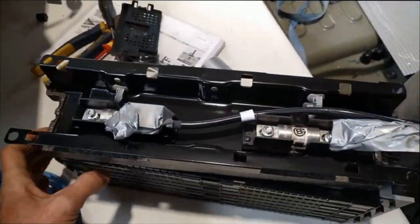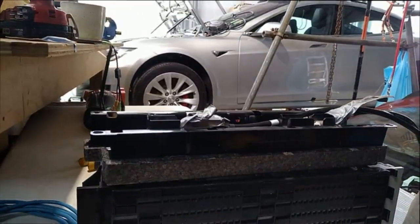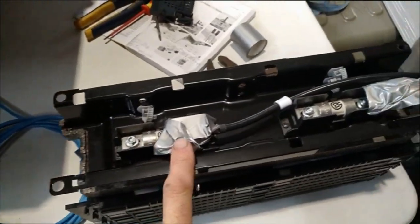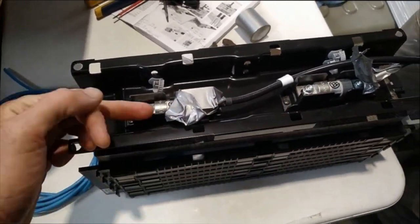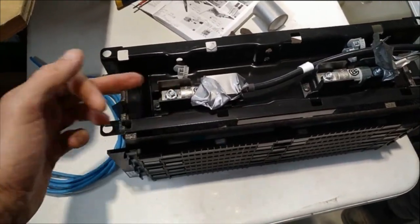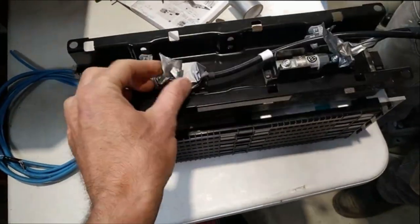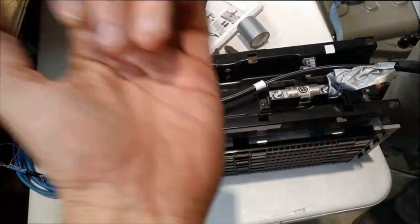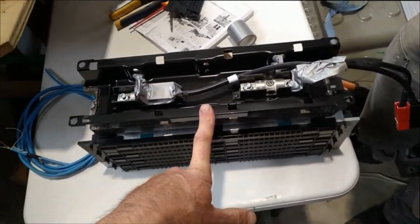The power from the battery comes up and out through a couple of fuses. This sits on top of everything. This unprofessional insulation is mine, because I was horrified when I saw inside. You've got the negative from the battery here and the main positive here, then fuses — and it just sits there with no insulation. It had zero, nothing on top of these when I received it. So you could be in here, drop your spanner, and short circuit 160 volts worth of lithium ion battery. And you'll be quite upset.